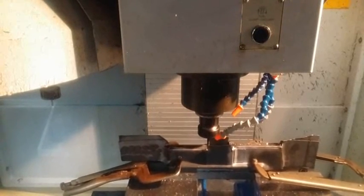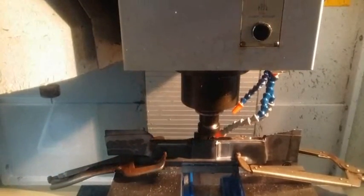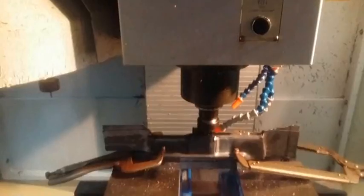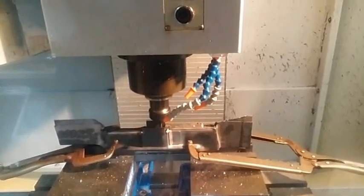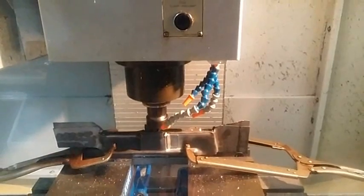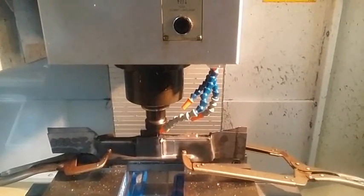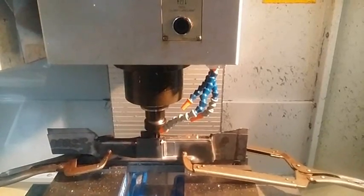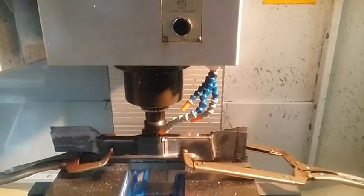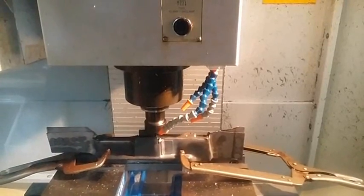The front of the mag housing area is completed. We will then machine out the back of the mag housing — again, a distance larger than necessary because of the excess sheet metal in that area on some of the receivers. We will machine it out so that the mag housing won't fit in exactly; there will be some hand fitting necessary after that.